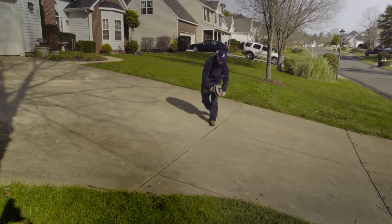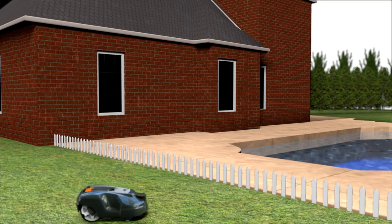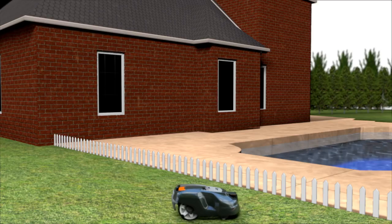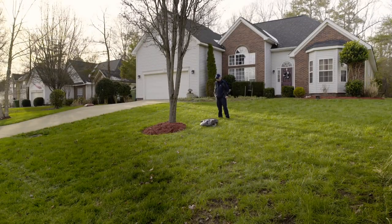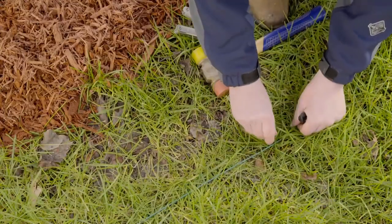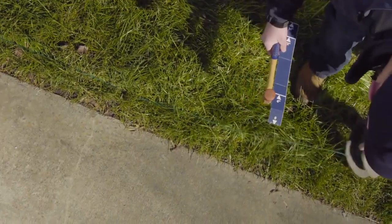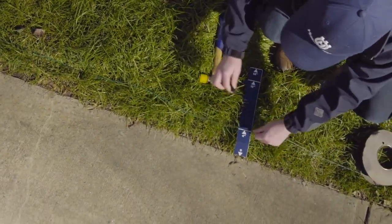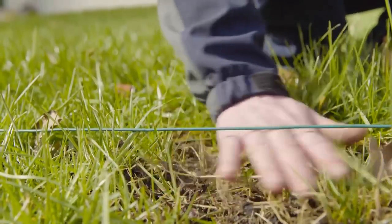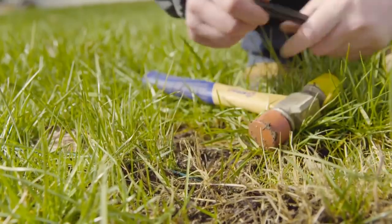On hard surface paths, you can just let the mower pass over. Around ponds, there shall be a barrier with at least six inches height for legislated security reasons. These are guide distances; to optimize mowing results, you can adjust the wire once you've learned how the robotic lawn mower works in your yard. Place staples on level lawn areas at a distance of about 28 inches. If an uneven lawn makes the wire hang in the air, you will need to use extra staples; otherwise there is a risk that the mower will cut the wire.